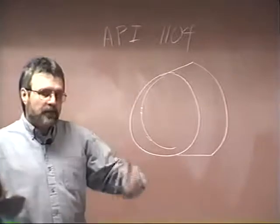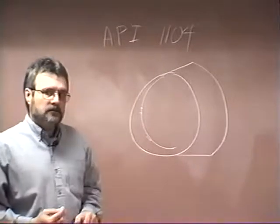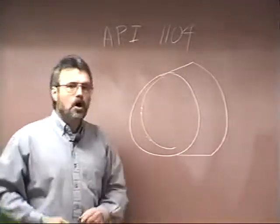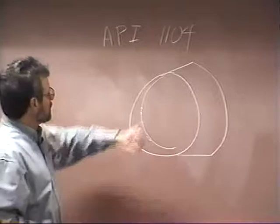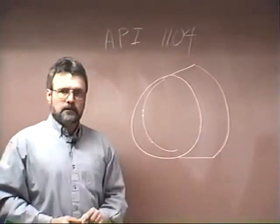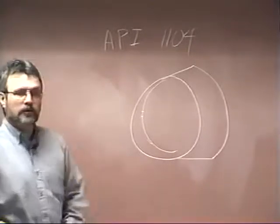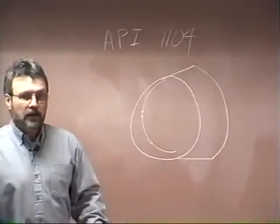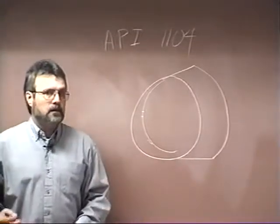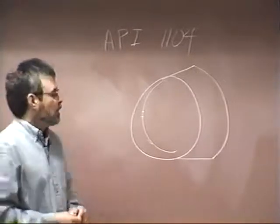So when you put that hot pass in, a lot of times when I inspect one of these things and I see these things, I could fail a guy. Because under this code, there's one all-encompassing statement that says this bead will present a consistent and workmanlike appearance. Well, if I see this stuff, hey, that's not a consistent workmanlike appearance, you're done.